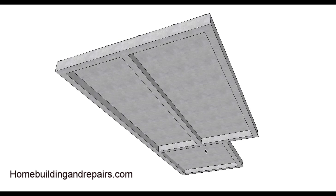Here are the footings. This would be the load-bearing wall — you can see the load transfer all the way down. This is the footing that supports it in the center, and here's the exterior footing for the two-story house. A single-story house might require smaller footings — you might get away with a 12-inch by 12-inch footing. For a two-story, you might need something 15 inches wide and 15 inches tall.